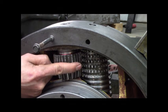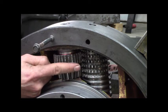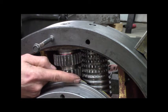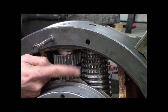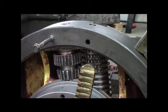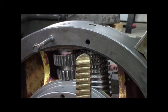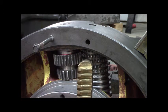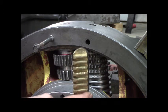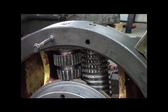What this is over there - it's like a worm, but not really, it's just like an Acme thread. It's an Acme thread worm, which meshes with the half nut right there. And that moves the offset slide for the boring head, which offsets your boring bar and gives you the radius.